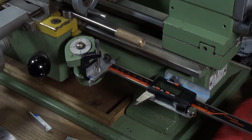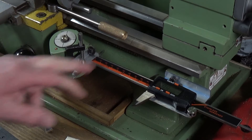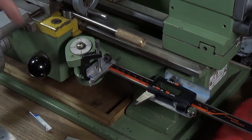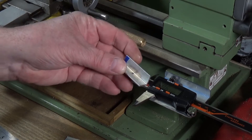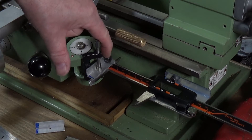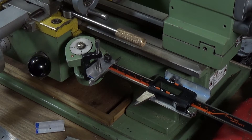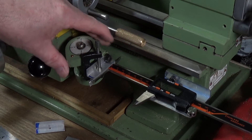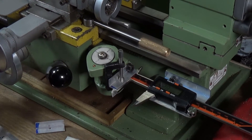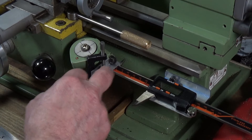The body of the digital caliper is fitted to the plate using just a bit of servo tape — double-sided sticky tape. This is a 150mm, just under six-inch caliper, so you get plenty of travel out of it. At the other end I used half-inch aluminium angle, drilled a six mil hole, slotted it, and picked up on the bolt that holds the thread index onto the carriage. Then I've used a small g-clamp to attach it to the moving part of the caliper.